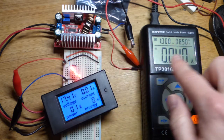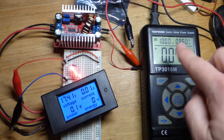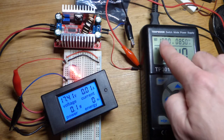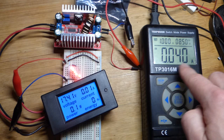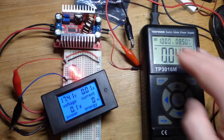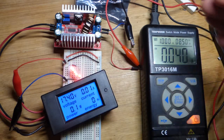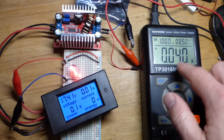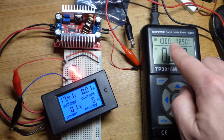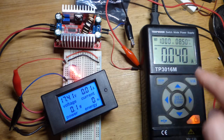When these fry, they just accept whatever current you give them. If I limit current below like 40 milliamps, then as I raise the current it keeps accepting more and more. Limiting current too much seems to throw off how it works. So make sure you have the current set to quite a bit more than you need to power the load.